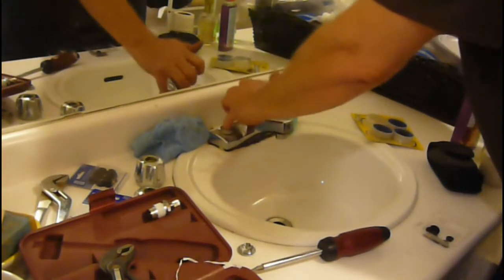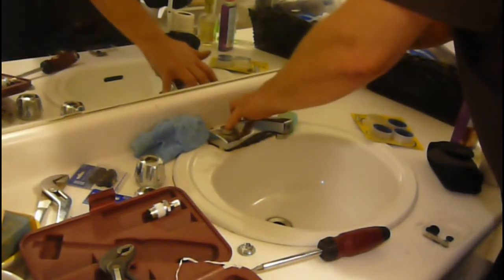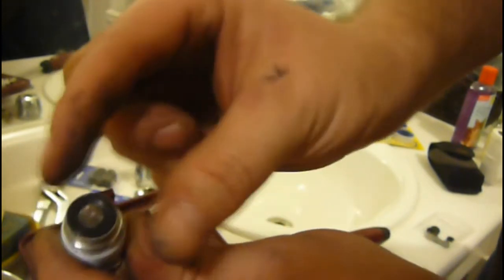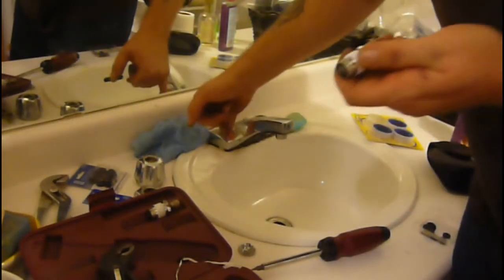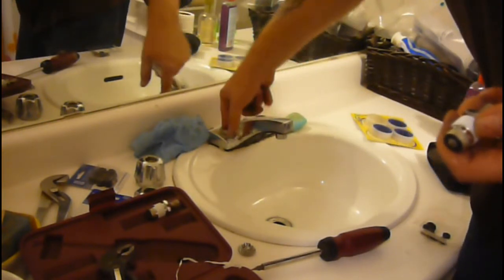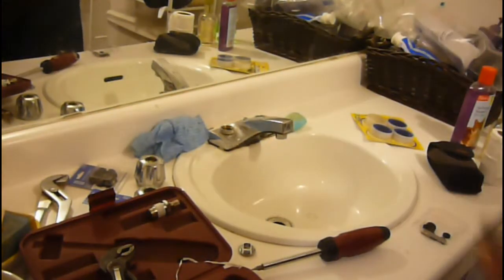What I'm doing is checking the seat. I see the problem — I feel it anyway. These bottom up on a smooth, supposedly round surface, and that's called the seat. The washer pops against the seat. I just put my finger down this one and cut it all to hell — it's almost going to fall off, and I can feel some roughness on that. Because I didn't come prepared to change a seat, that's going to have to stay. But basically, seats are fairly easy too — we'll get into that some other time.